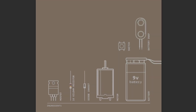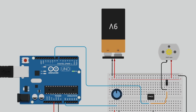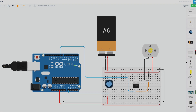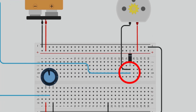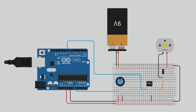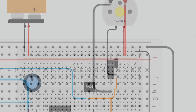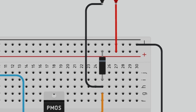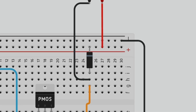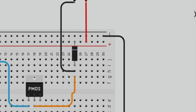There are a few cool things to take into account in the starter project. The DC motor requires a lot of power to operate, more power than the Arduino can provide. So to account for this, we utilize an external 9-volt power source. We also need a way to get the Arduino to communicate with the motor — we simply can't just use a wire to connect them. The component we will be using is called the transistor, which allows us to send a signal from the low-current Arduino to the high-voltage motor so that we can turn it on and off. Finally, we need to add a diode. Diodes only allow current to flow in one direction. This is important as the DC motor will generate an electric current of its own called back voltage, which can flow back into the Arduino and fry it. So placing the diode in this position will prevent this from happening.